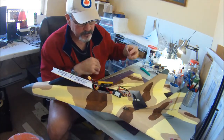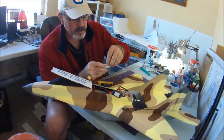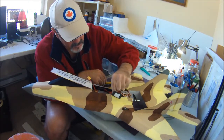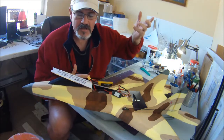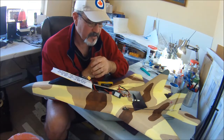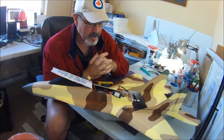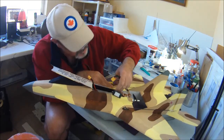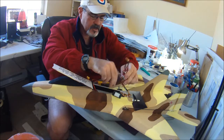Now, on this Turnigy Plush, the heat sink is sort of on the top. If you're worried about too much heat transfer to your battery, I've just been tucking in a little scrap piece of 3mm Depron. It's supposed to be insulation, so hopefully that'll prevent a little bit of heat transfer. I mean, you're only up there for 5 or 6 minutes flying, unless you're flying in like 40 degrees Celsius, 110 degrees Fahrenheit, or whatever. Things shouldn't run that hot on a 5 or 6 minute flight. I have to get a new piece of Velcro on my speed controller here.